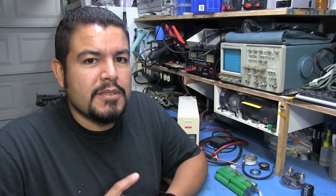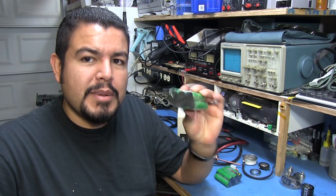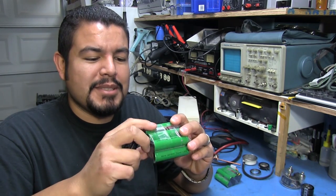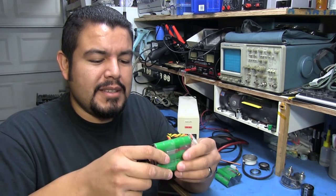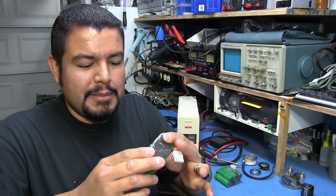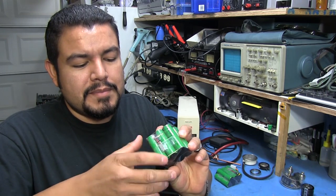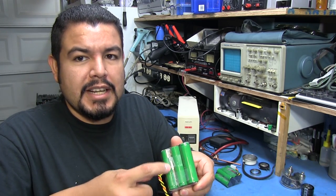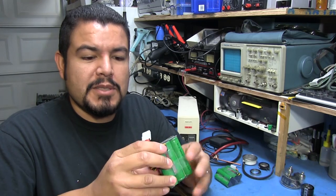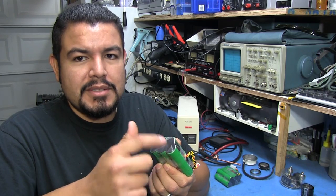I had to recycle a few parts from the original battery packs, but it wasn't much. These are my new battery packs — kind of ghetto, held together by clear packing tape, which was thin enough not to increase the size too much but also thick enough to be pretty sturdy. I reused parts like the thermal fuse, another fuse, a plastic bracket, thermistors, and the little black end caps which cover the nickel strips welded onto the battery.